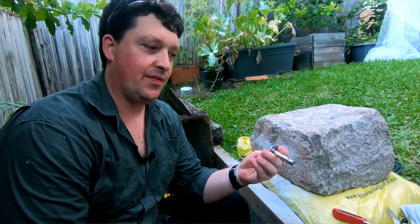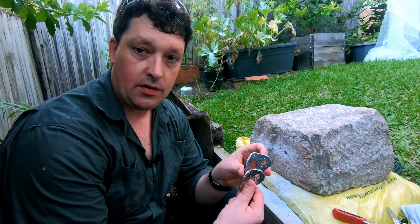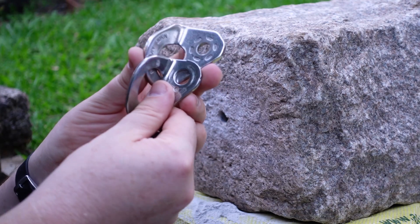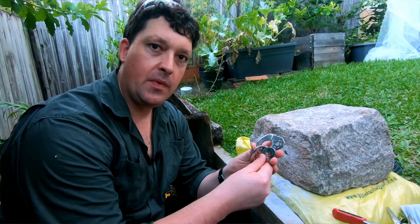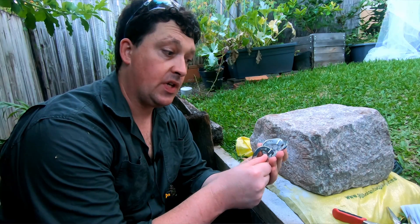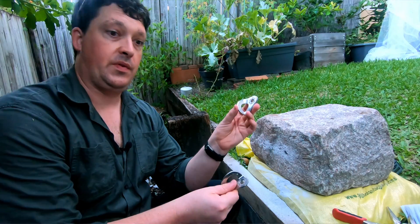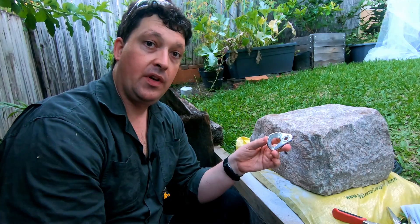This is how you install a flush head sleeve bolt. With these bolts you can mount either the smaller hole or the bigger hole hangers — in this case 10 and 12 millimeters, or if you're in the States using inches, that'll be half inch and three eighths. The nicest way is to use the ones with the smaller hole, so in this case a 12 millimeter bolt.